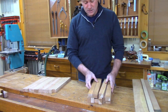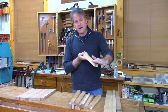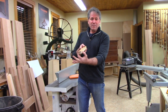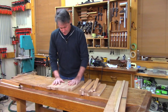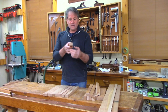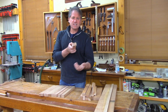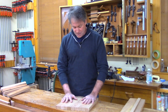I'm not going to go a lot into prepping this. What you want to do is joint one edge, then run it through the thickness planer. When they're all at thickness, the edges need to be trued up — joint each edge so that you can glue them up. All of these have been thickness down to about one inch, and they're about an inch and three-eighths, inch and seven-sixteenths wide by the time I joint them. It really doesn't matter. Now I'm ready to start arranging my pieces.